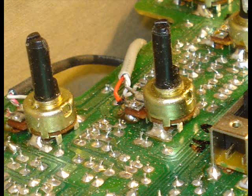Now that's the cable on the inside of your computer that connects to the CD-ROM drive and carries the audio to the motherboard, so when you play a CD, that's how it works. I've got tons of those cables laying around here, and it finally dawned on me that it's 2-conductor: you've got a red wire, a white wire, and then the shielding.